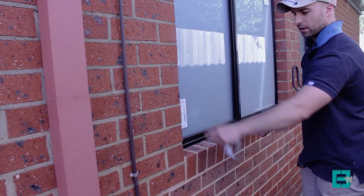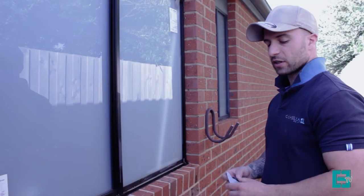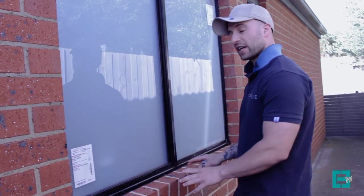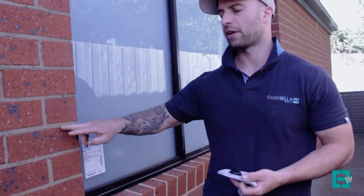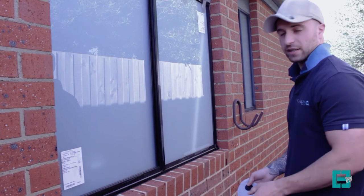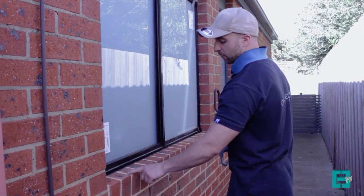actually a bit older. How we managed to get the exact same sand and mortar mix was selecting the right mortar from the quarries. And what you actually have to do, it's a bit time consuming, and a lot of brickies that are listening are probably going to tell me I'm mad, but to get the best possible outcome, you actually need to go to four different quarries, maybe three, depending on the similarity of the sand. You need to make the mix, three different samples, let the samples dry, come back 3 or 4 days later, and have a look to see how it's dried.